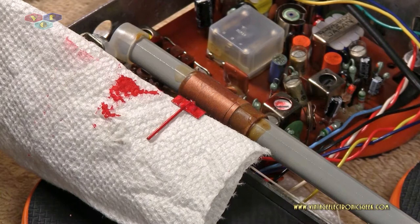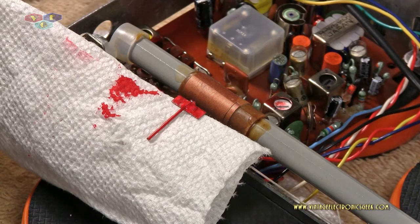No big deal. That is the first coat. The LED, or the light on the radio, I traced it back to the board, and it only works when it's plugged into 12 volts through the car chassis. So let me rephrase that. It only works when it's plugged into the car chassis, and that could be 6 volts through 12 volts.